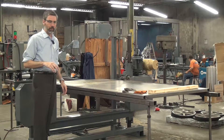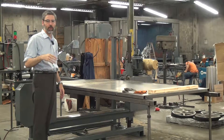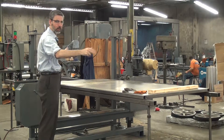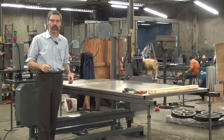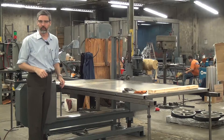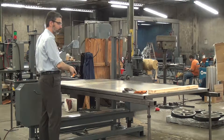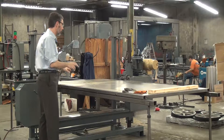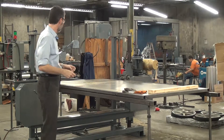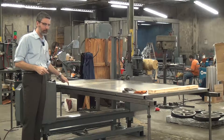The original idea for this was to cut sheets of material off a large block. Say you had a block four foot by four foot by eight foot long and you want to make a bunch of one-inch thick sheets. You would set the blade one inch above the table surface, put your workpiece on the table, run the workpiece through to get your cut off the bottom. You then take the workpiece back to the head of the process, set it down and cut through again. This means you don't have to change the setting of the blade above the table surface.